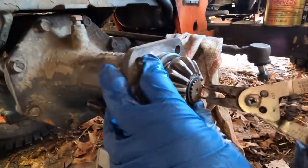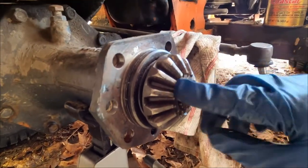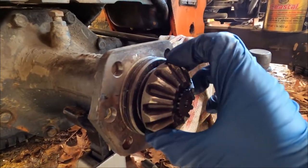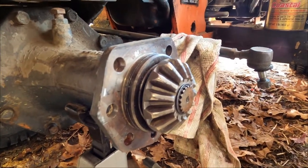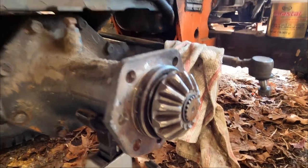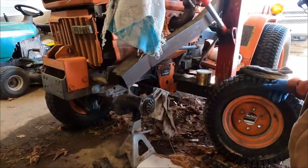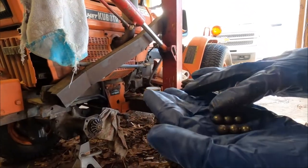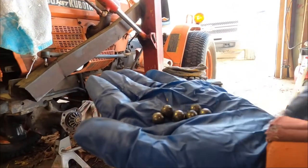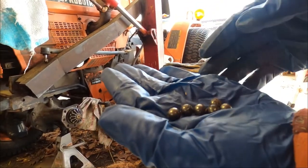Man, that's a lot easier than trying to get it off with a pair of screwdrivers. Okay, so it snapped in there, when you got the tool. There's a little bit of slop, but not much. Just a tad bit. Okay, I'll set those there. Now we got to press the bearings into this. There's what was left of the bearing. All we had was the steel balls and a few pieces of shrapnel we found in there. That was why it was all chewed up.